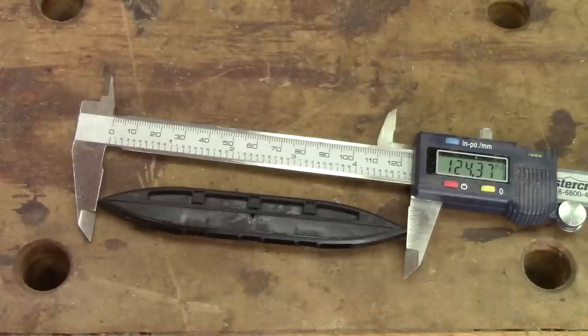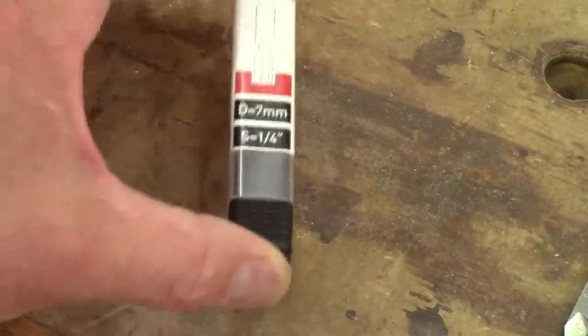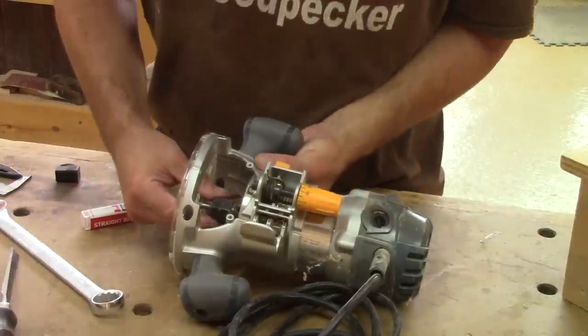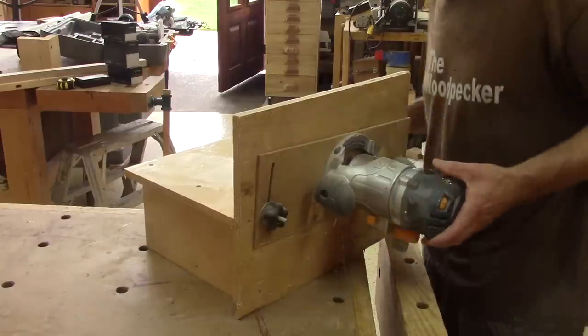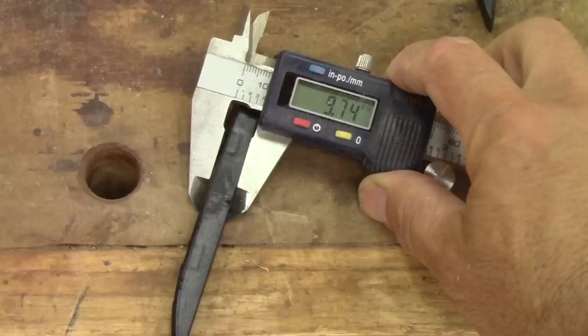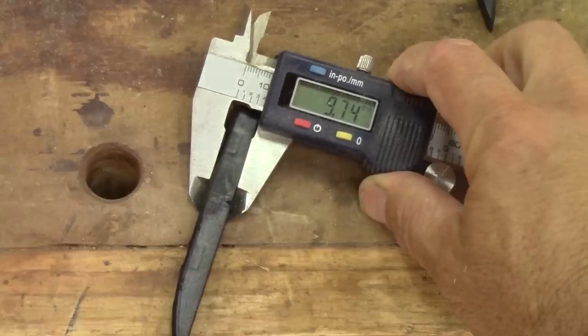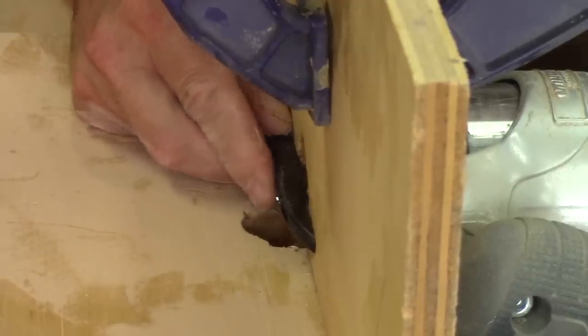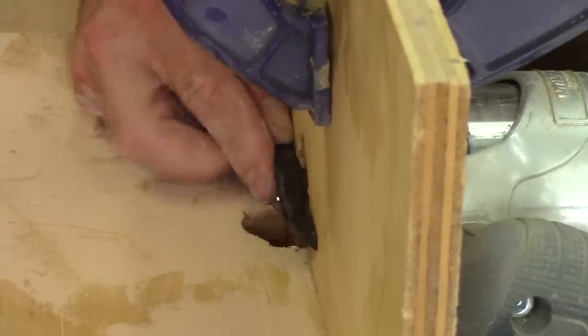But the size is not that important here. To install it, you need a 7 mm straight router bit. Since I didn't have one of my own, I bought one — that is all you need. After installing the bit in a router and putting it on a router table, we're almost ready. First thing to do is set up the depth of cut, almost 10 mm. But it's way simpler to use the female part of the joint to set up the depth.